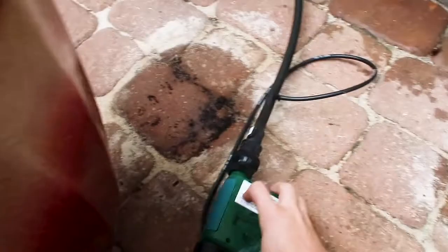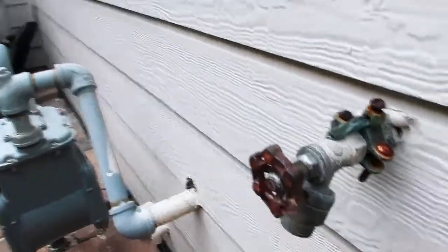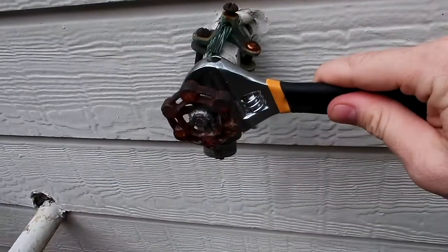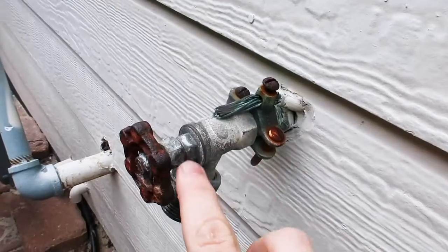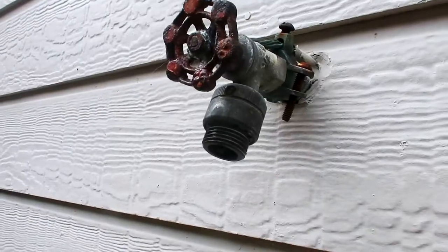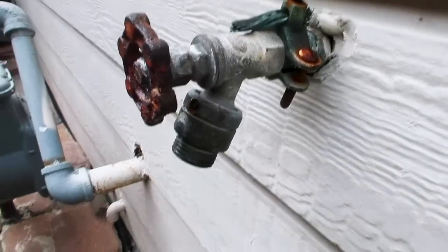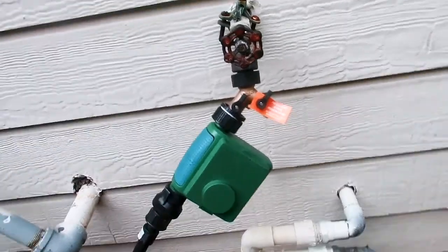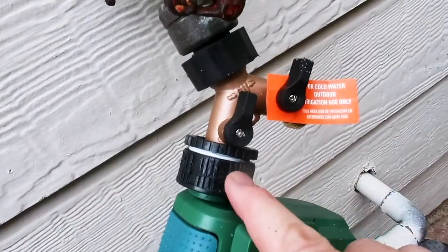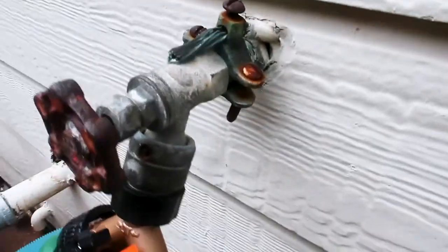Here with a little voiceover — here are the items in need of repair. What needed to be fixed was the packing nut in the back. It was a little loose, which causes leaks at the handle and the faucet below. So I turned it about a quarter to half a turn and documented showing that the leak stopped. I took pictures and video of the item not leaking anymore. Then I reattached their water fixture and saw that the threads were leaking, so I added some plumber's tape and fixed the threads there too.